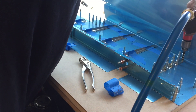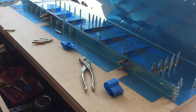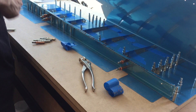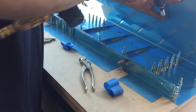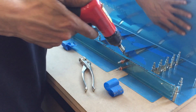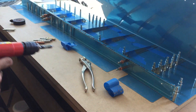Watch your chuck on these ones — it's a little too close. I don't want to screw my skin up with that chuck, so I put some tape on it. Glad I did that — caught it a wee bit. It's also why I leave that blue film on — a little bit of extra insurance.